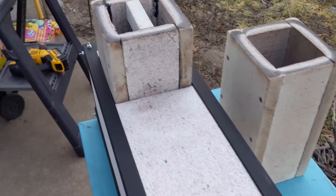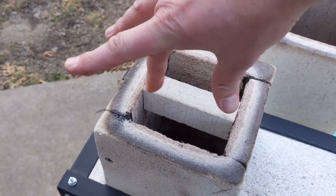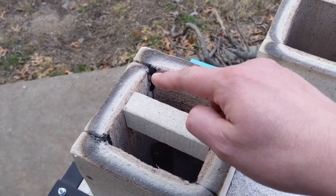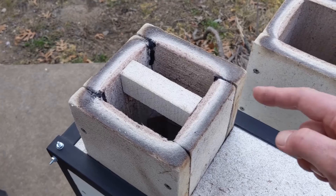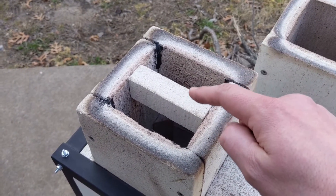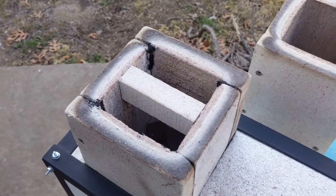I had to make a few fixes. These boards were starting to bend inwards a little bit, so I put a small spacer in here and added some more gasket cement which is drying right now. I'm going to fire it up in a bit so that the gasket cement cures. I'll leave the spacer until it's fully dry, because otherwise it will just push back in.